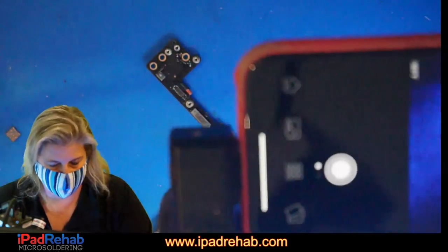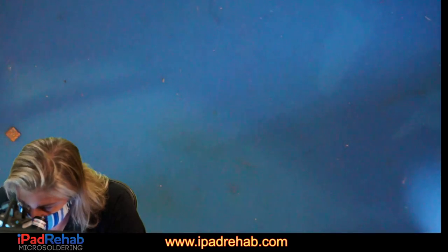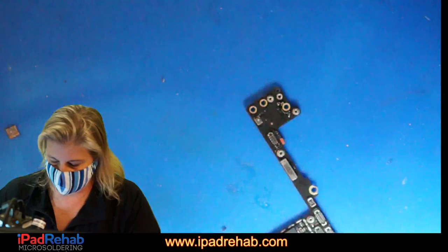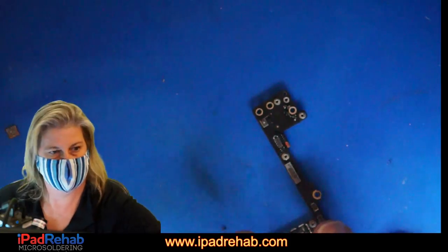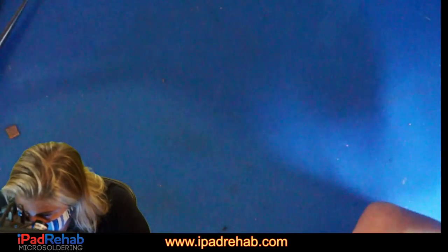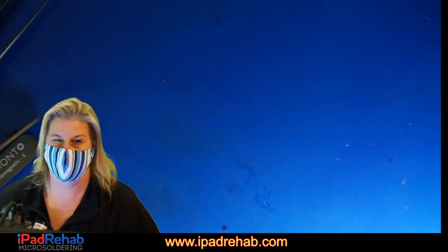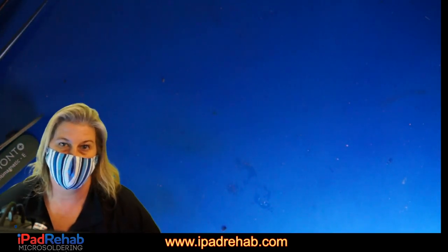Now let's see what happens when we prompt it to boot with tweezers. When we prompt to boot, it hangs at 236 milliamps. Let me try that again. At 186, prompt to boot, and let's see what it does. It goes to 236 milliamps and then hangs out. 236 milliamps hanging out is kind of what a brain dead phone with a leak would do.